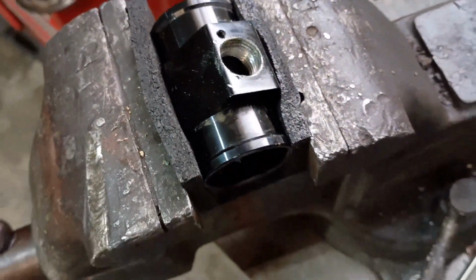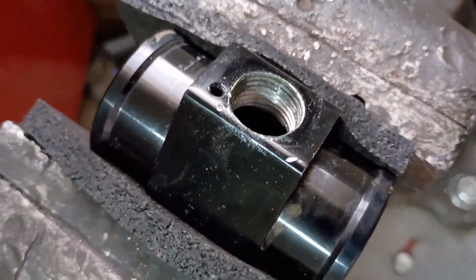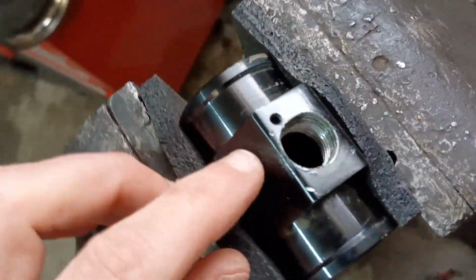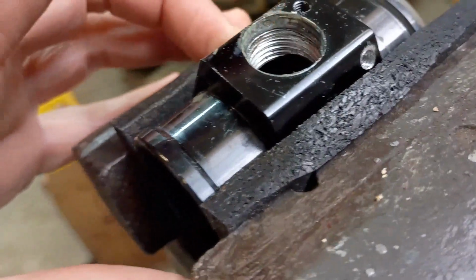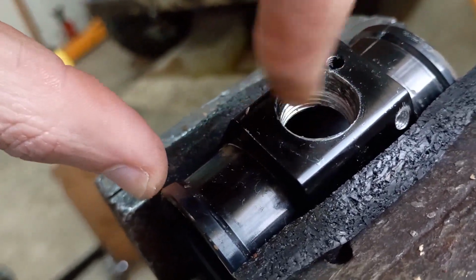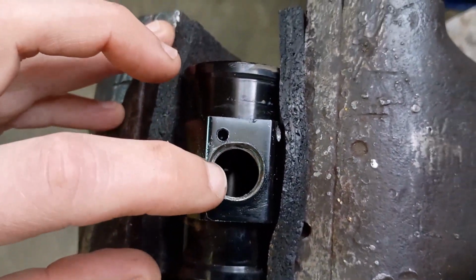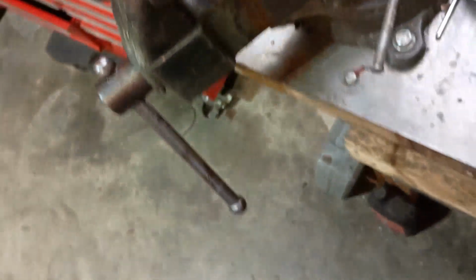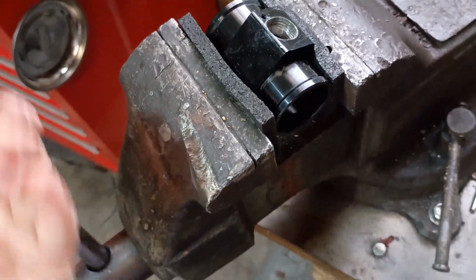But since I was drilling with an undersized bit, I tried kind of wallowing it around, and I wallowed it too much so that over there at the top, kind of hard to see, there's really no threads basically over here. And you can see there, once I drilled this open, it was really close to that ground lug, so I drilled and tapped a new ground lug. So I had some work into this and screwed it up. But it's a $9 piece, that's why I bought extras.